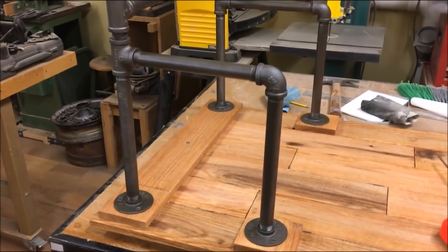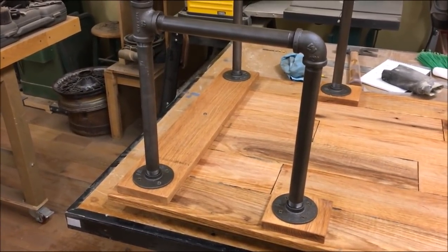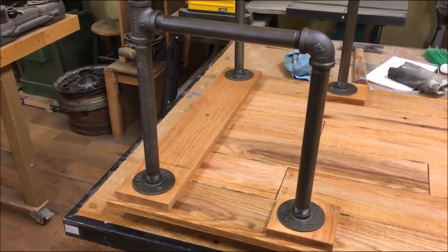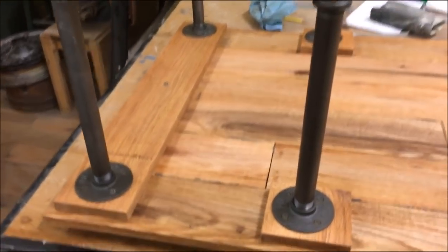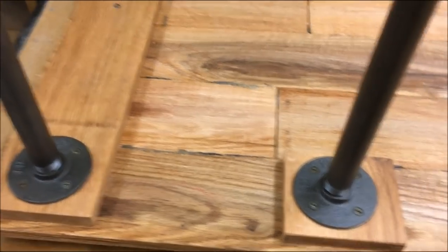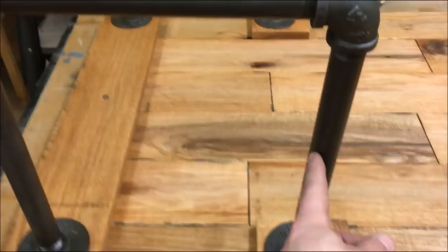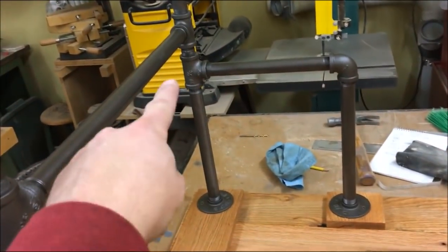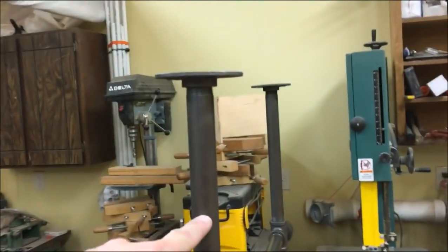I'm installing the legs. They went together relatively easy. The biggest problem is that black pipe is absolutely filthy, so I actually had to spend quite a bit of time with a solvent and a lot of paper towels to get them clean so I could give them a quick coat of paint. They've got a very light coat of paint right now just to even things up, and it's really helped — they look great. I'm screwing them in with three-quarter inch screws so that they go into the blocks and not into the actual top. Basically the way I've done it: the first leg sections are all 12-inch pieces, the cross members are 10-inch pieces, and then there's a quick union. I had a custom 20-inch piece cut at Home Depot — they'll cut and thread it for you basically for free — and then another 12-inch piece and then a foot.